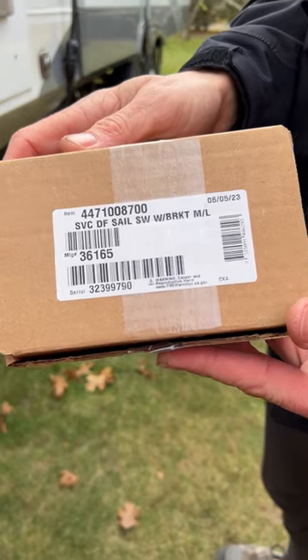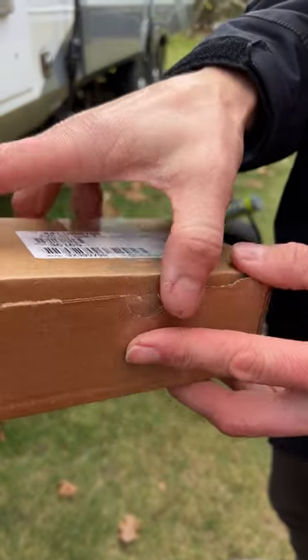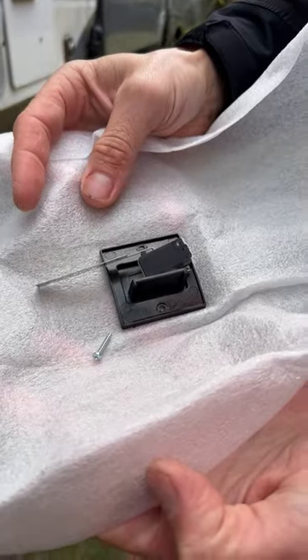It starts to flame and you get heat inside the RV. If that's not happening, make sure the propane tanks are full so there's plenty of pressure to the furnace. If it runs around 90 seconds and shuts off altogether, look on the furnace for the error code — there'll be flashing lights coming off the circuit board. The error code lights shine toward the top of the furnace. One light flashing for one second means there's an airflow fault, which normally means it's the sail switch.